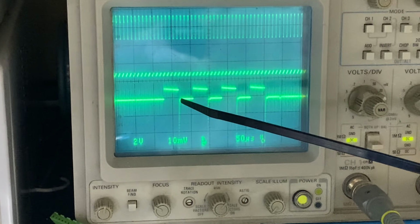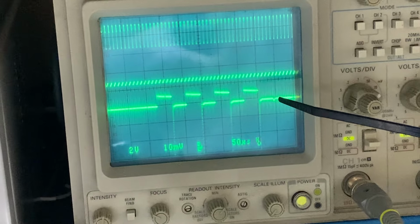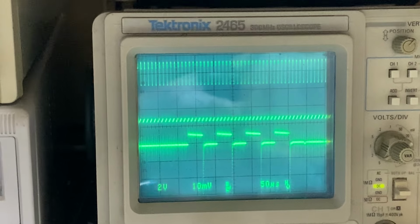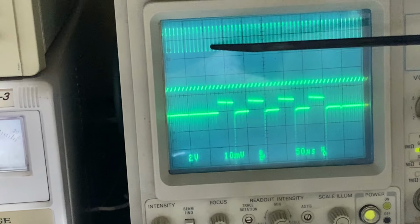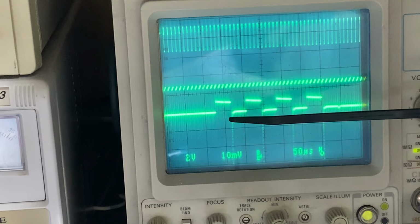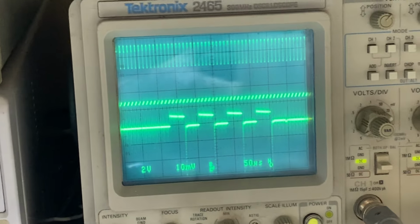And in this time period here is where you're receiving, there, and in here, and then there's more dead time, but the pulse detector's picking up just about everything. On the top trace, that is a switch mode power supply, and as you can see, it's got lots and lots of oscillations. What these are doing, they're falling in the receive window at the same time. So in the receiver, the way these are set up all on the one circuit board, some of this leaks into here and absolutely trashes the receiver.